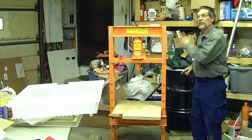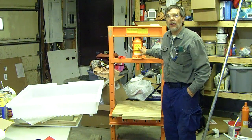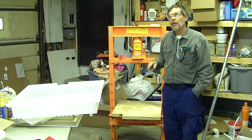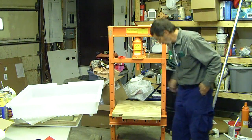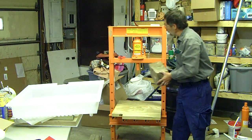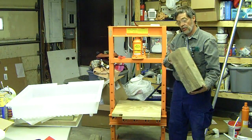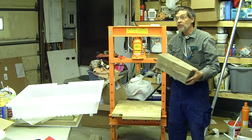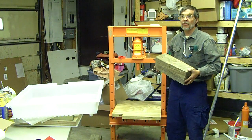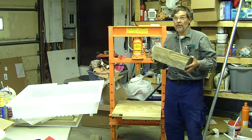I'm Al Yelpington, and this is going to be my cider press. The 20-ton jack on the top has 5¾ inches of throw. This is important because the method of making this fit, as you keep pressing, is to use wooden blocks. The first blocks I'm going to put in there need to get past the press pin. These are about 8-by-8 blocks, but once you get past the press pin, the most you're going to be able to put in there are probably 4-by-4s, because a 6-inch block is not going to fit in a 5¾-inch gap.